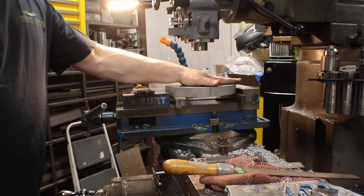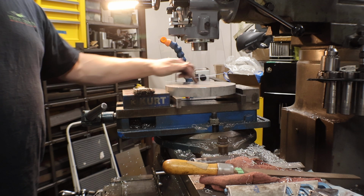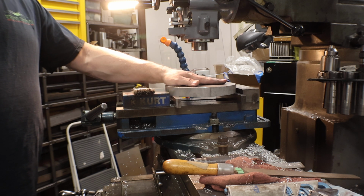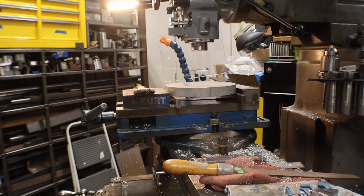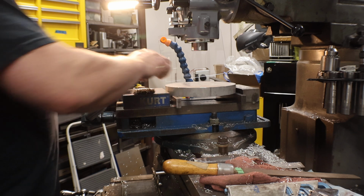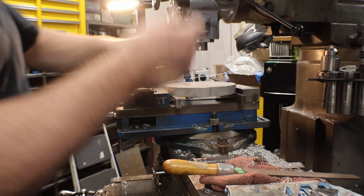Okay, so we're going to be putting in through bolt holes for 1/4-20 bolts, and they offer a loose fit and a tight fit. I'm going to do the tight fit because I tend to keep on my numbers. So let's see what it says. It says the letter F drill. Let's see if I have an F. Yep. Okay, so got the center drill.